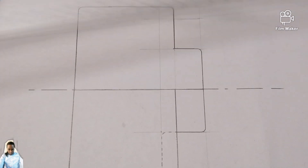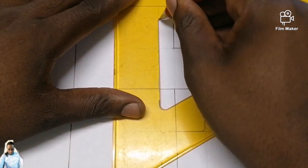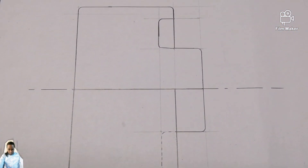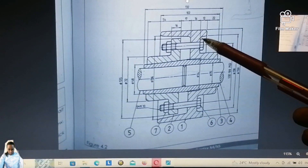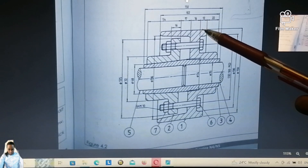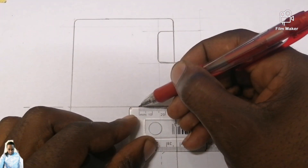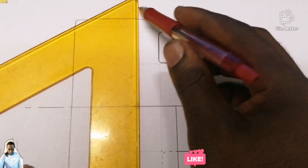You can now further extend it just a little bit so that now you can have this. That now this side - there you go, solid. And this side as well. Then from there we are going to deal with this 16 millimeters from here till there - because this is 12, we've gotten this one. From there till there is 16 millimeters, we are going to get that thickness. So there is your 16 millimeters - there is my 16 millimeters as I've gotten it. I draw a faint line for now, there it is.